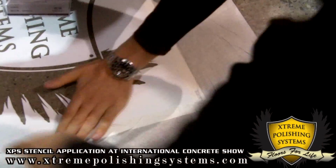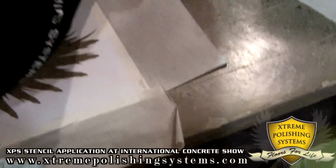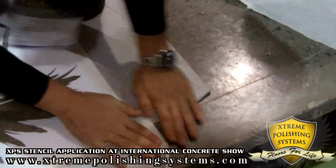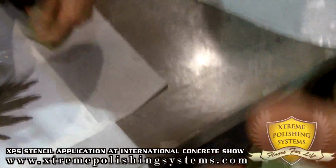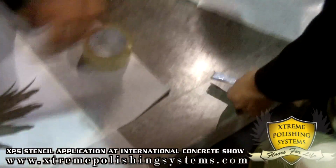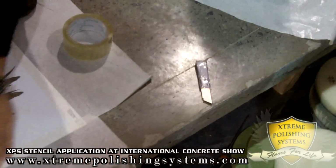Is it necessary to polish after applying the concrete densifier? Yes, it's good because it closes the pores. It has a nanotechnology which gets into the concrete and seals the lower part of it. So it closes the holes and makes the concrete shine much better at the end.